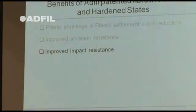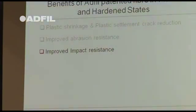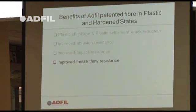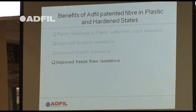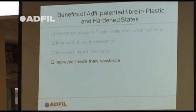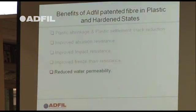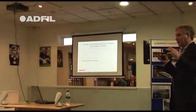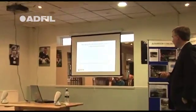In external yards where you've got lorries going on, you want improved abrasion resistance where lorries are turning and slewing around. You also want to prevent damage caused by dolly wheels and forklift trucks picking up a pallet and dropping it on the slab. Also — and quite controversially, though we've been doing this for the last 14 years — improved freeze-thaw resistance. Adding plastic fibres into a good concrete improves freeze-thaw resistance. We've been supplying fibres into about 500,000 cubic metres of concrete in this country just for that purpose. You can also get reduced water permeability because it reduces bleed channels developing in the concrete, and if you've got fewer cracks, you've got less penetration of liquids and water.